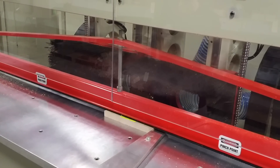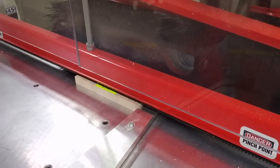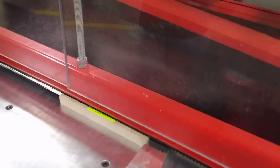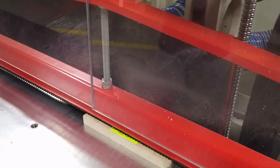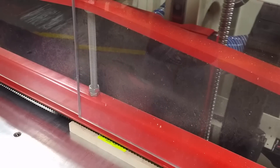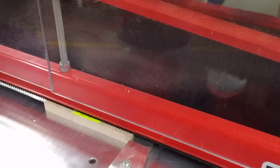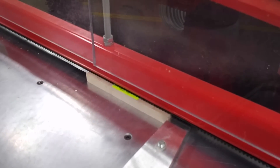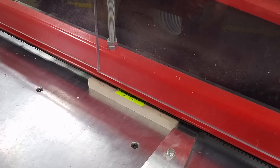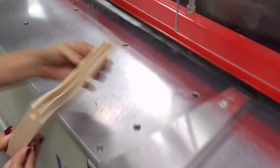This one will likely do a hogging cut. It did a half pass, now it's coming in from the other direction with a different tool, and then finally it's coming in with the finish cut. So it did two hogging passes and then a finished climb cut to give it a really nice finish in a more difficult shorter maple arch. Go ahead and pull it out of there and flip it around. It's a very nice clean cut because it did two hogs and then a finish cut.